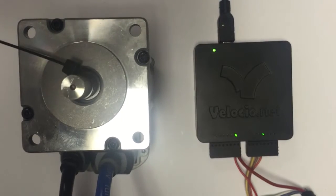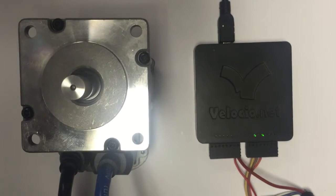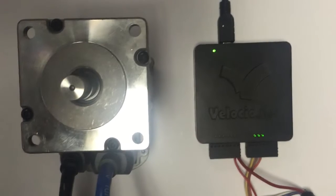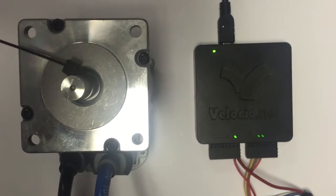It's time to speed things up and show you what can really be done with this combination of equipment. I've changed the code in two ways: we're going farther — we were going one rotation in each direction, now we're going 10 times — and we're going faster. We were going 3,200 steps per second, and we've cranked it up to 200,000 steps per second.